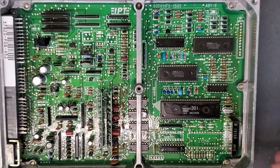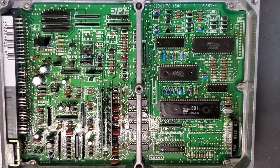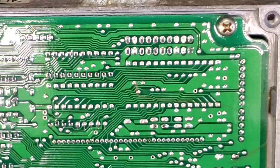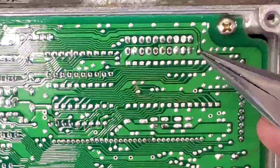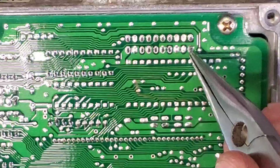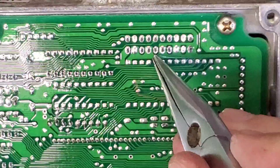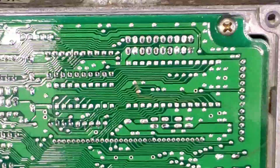What we're going to be focusing on today is the resistors for RP-18 and RP-17. With the motherboard turned upside down, this is the section that we're looking at. Starting at the right-hand side of the board, furthest away from the plugs, that is our RP-13, and we'll work our way in to 17 and 18. We'll desolder these two and take them completely out.